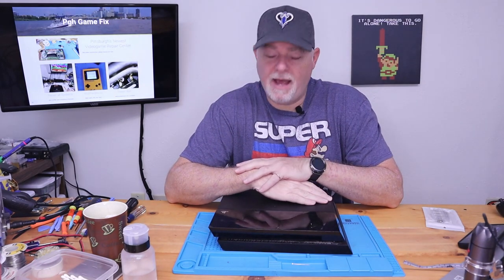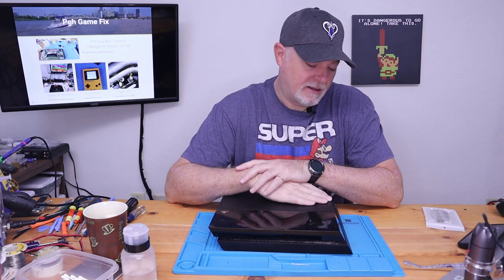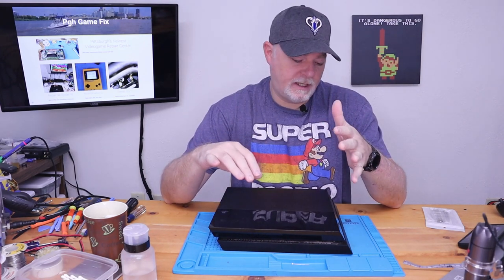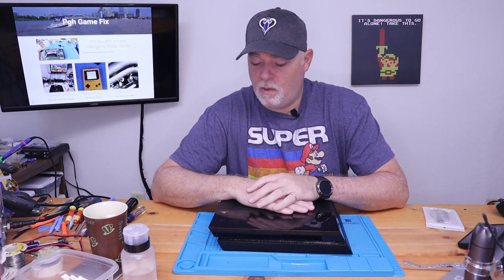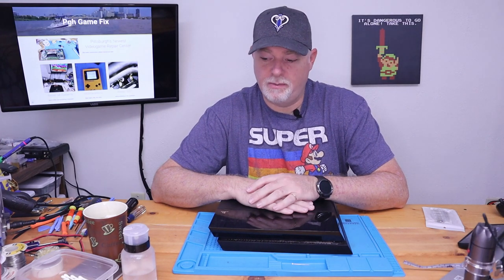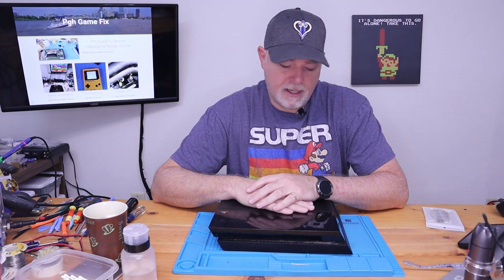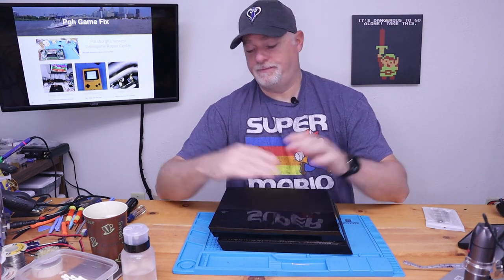Today on the bench, we have another PS4. Since the PS5 came out, it seems like a lot of PS4s have come into the shop. This one has no video output. The owner suspected a bad HDMI port, and after looking inside of it, I agreed. Several of the pins were shoved sideways, and it's definitely in need of a replacement. So, without ado, let's get this thing apart.